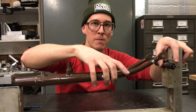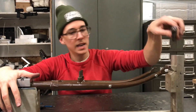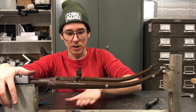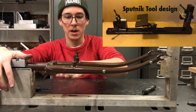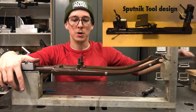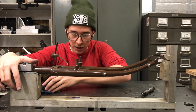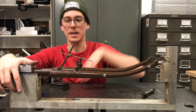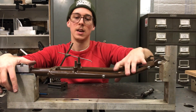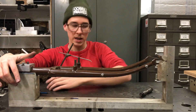The fork tubes I would have bent, or they would be straight leg, or whatever they were. This would be clamped down here. Some fork fixtures have a bar that lifts up that you can spin to touch against both sides. What I would do is set this height gauge, feel along the top of one side, swing it around, feel along the other side, and get them to match — that's how I would check level.